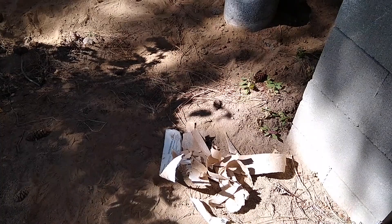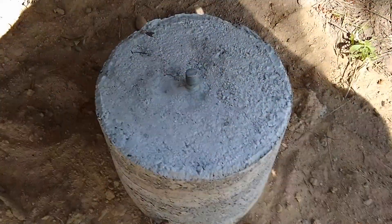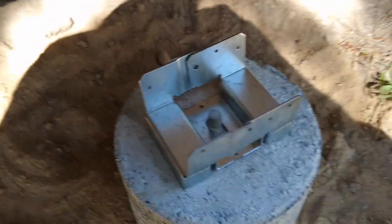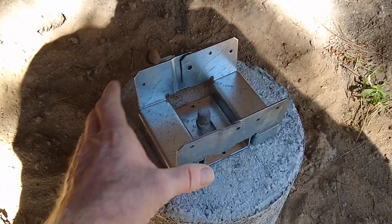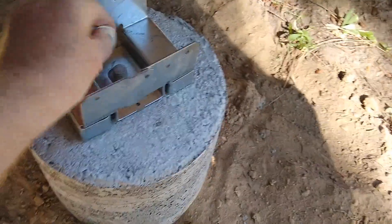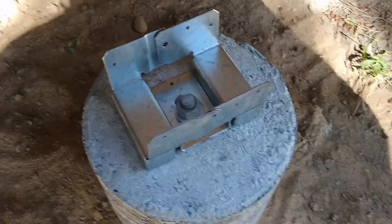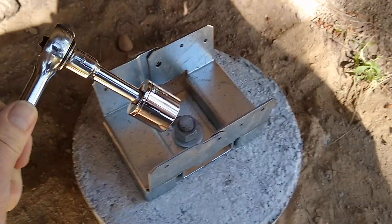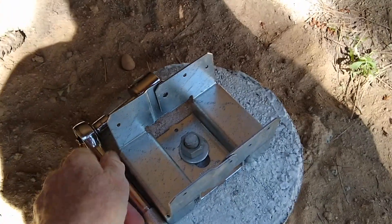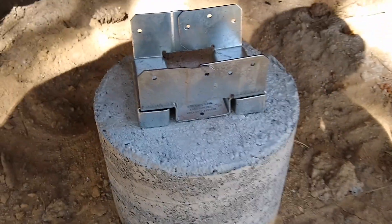Now I've got the top part filled up — and there's what it looks like. Next, let's put on the bracket. I took the nut off and I'm going to put on this stand-up bracket, which keeps the post a little bit away from the cement so you get less rot — it's got a little adjustability to it. Next comes the washer, then the nut, then I tighten it down with a socket. But I'd better make sure it's in the right spot, so let me get the plumb bob out — that takes two hands, so I'll set down the camera. There we go — I'll bolt it in place, should work out just fine.